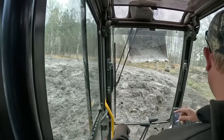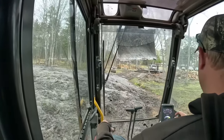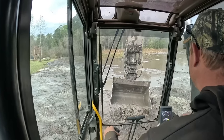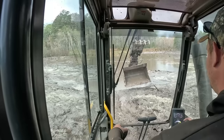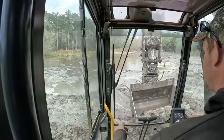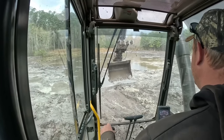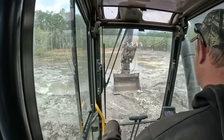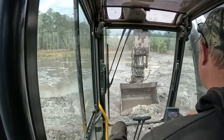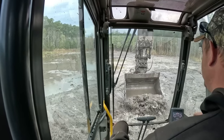All right, let me slick this up and see if I can't work my way out of here. It's getting kind of all right. This is probably the last video working. I am working my way out right here, the last little section, trying to grade a little swale to catch this spring that's on the side of the hill and divert that runoff into the pond.